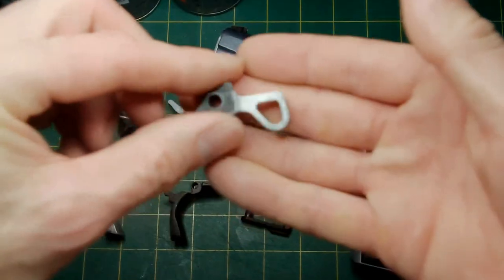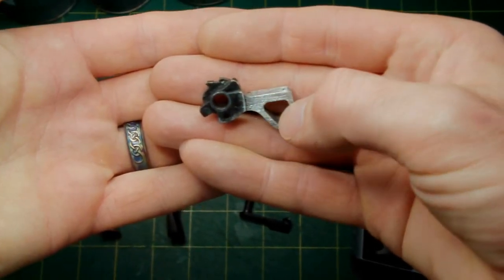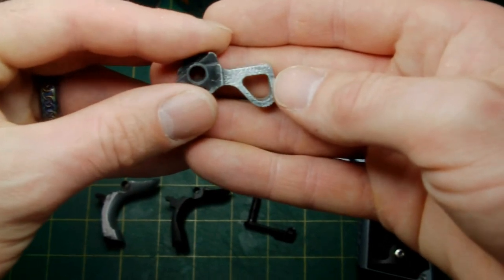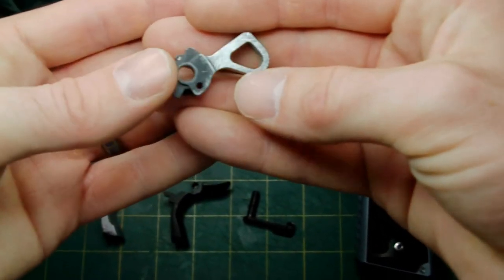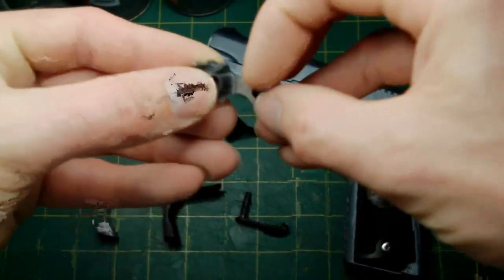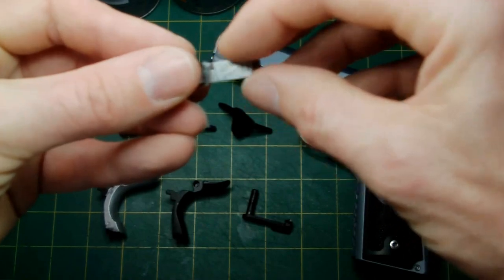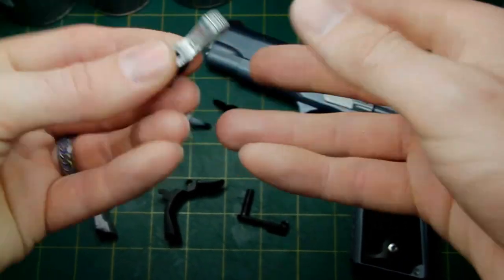So if you want your part to be painted, the first thing you need to do is sand it down. As you can see, I've left a key — that's what the paint will adhere to. This was originally polished; I now want it to be sprayed black. Use 120 grade or 60 grade sandpaper — any grade — so long as the score lines are there. The key is enough that it won't show through the paint but enough that the paint will grip to the metal. Also, around the edges, sand them so they're slightly rounded and not too sharp, because a sharp edge will chip a lot easier than a rounded one.